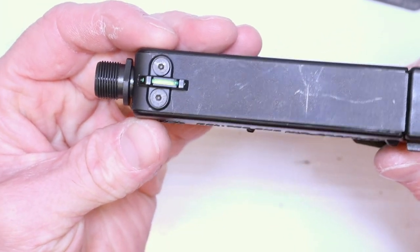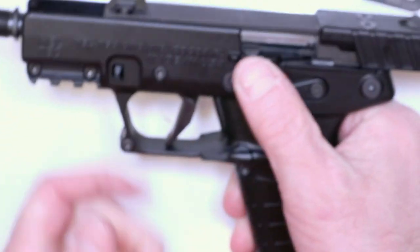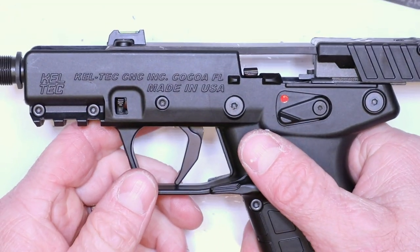So it may slide back and forth or it may not. The key to this is having your bushing back installed. If your slide is locked up after you put it back together, that's what you need to do. You can go with the standard bushing if you don't want to have your threads exposed, or you can go ahead and put your threaded bushing on if you're going to run some kind of muzzle brake or a suppressor. Just tighten that baby on hand tight, and then you've got that tool that comes with it. This will put the actual external threads nice and tight on there. You can also use a socket wrench or adjustable wrench. We are good to go, all set.